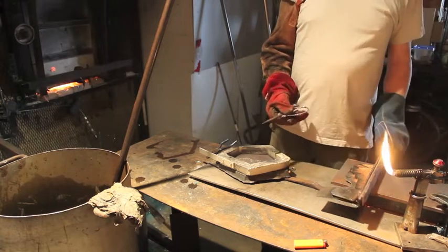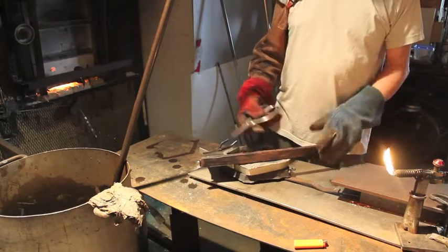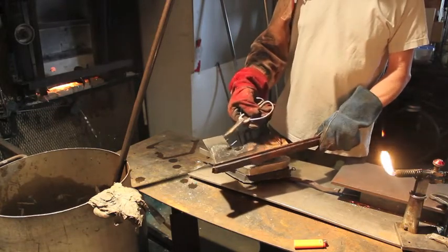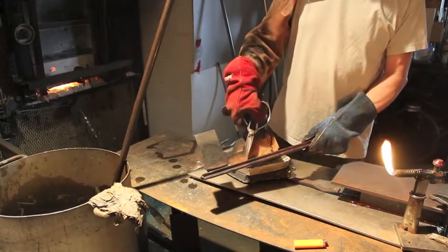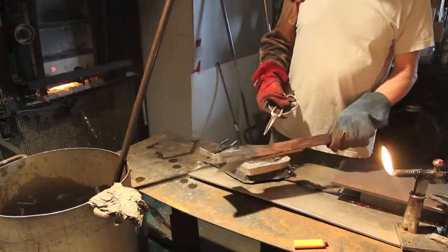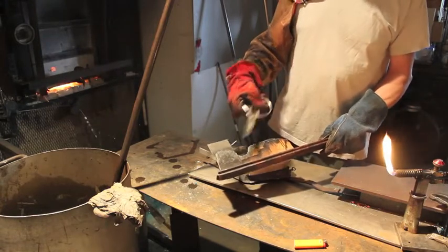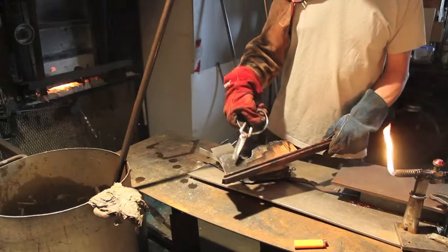I also have various tools for lifting. I don't put hot glass onto gloves and carry it to the annealer — I make a tool specific to whatever I need to carry. This one is made of a piece of teak flooring, a piece of mahogany plywood, and a piece of sheet metal. It gives me mechanical support and insulation so that when I carry pieces to the annealer they don't lose any heat and crack.